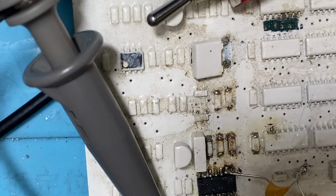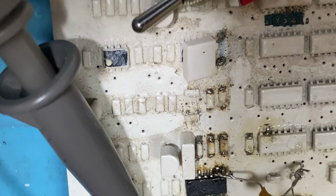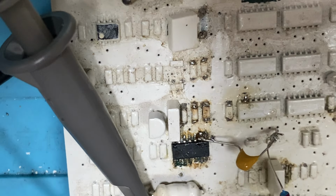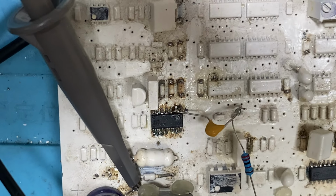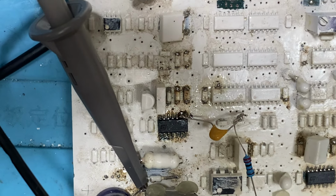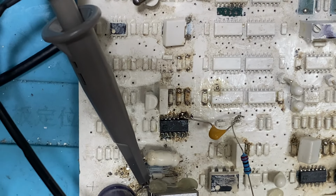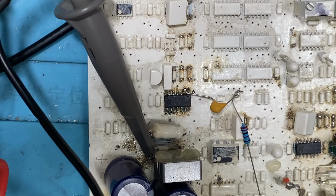As you can see, the other pad, I don't know if I can do this, but I'll try. You see the pad on the board? It is not connected to pin 9. I've lifted the pin up and I've soldered the 4.7 nanofarad. And on this, I have seen that there were some designs out there that had two diodes connected somewhere on this line. You don't need to do it, and it's better switching if you don't do it. It switches harder and cleaner.